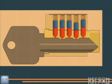But if you look at the 4th pin, and we start normally counting from the shoulder to the nose, that pin is on the correct height. Which means that if we consider the lock as not one lock with 5 pins, but 5 locks with 1 pin, then lock number 4 is open already. That would turn. You probably can't feel it when you turn it, but it does turn a bit further, because that one was preventing it from locking, and now it's another one.